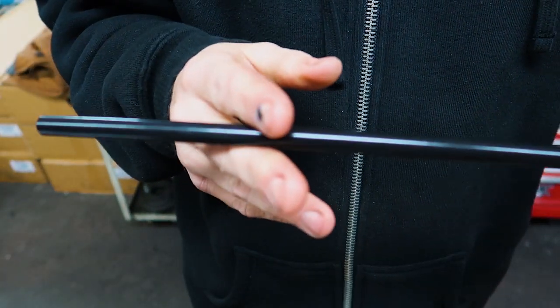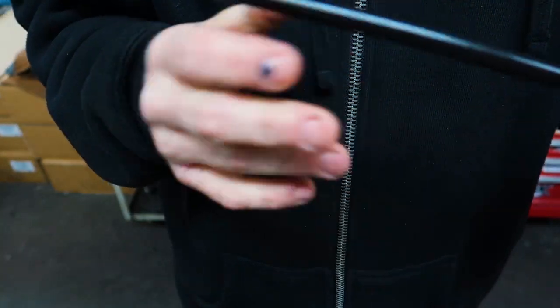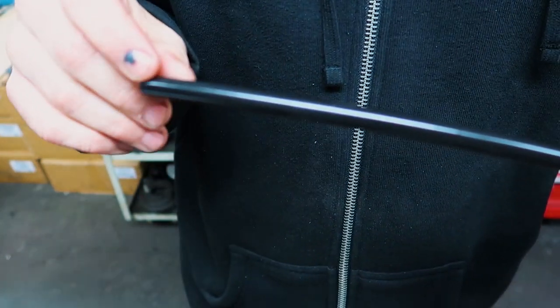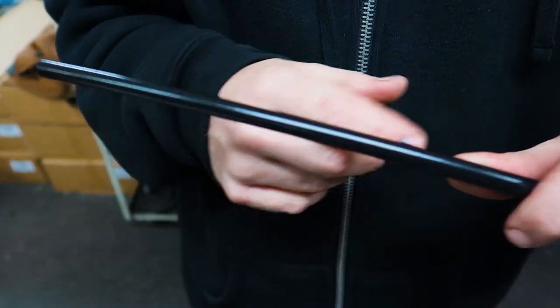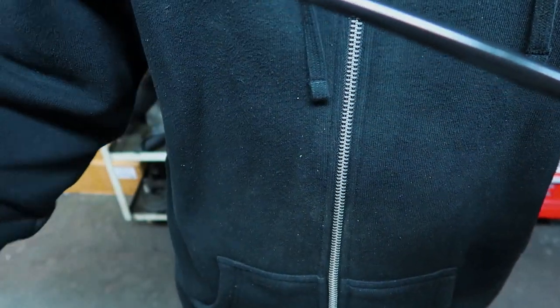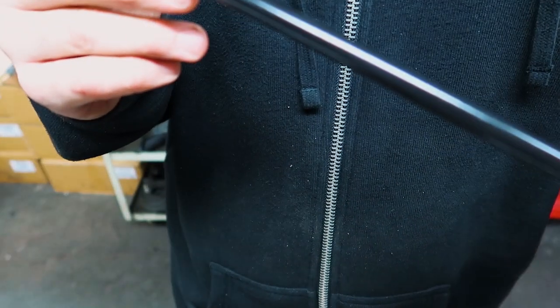You'll have a nice clean, pristine hose right where you're going to be sealing. If it gets a few scratches along the back side, as long as you clip the end, over time you never have to replace the hose. There's nothing more frustrating than finishing a full install and having one fitting leak, then looking at your hose and seeing a gouge from one end all the way down — and if you cut the gouge out, your hose would be too short. Using a little bit of electrical tape is cheap insurance to make sure you have good seals on your fittings.